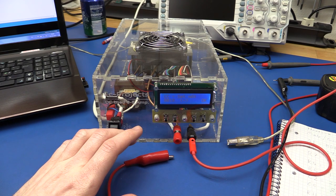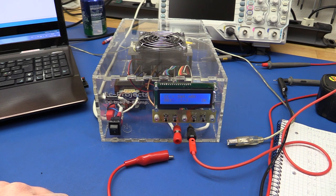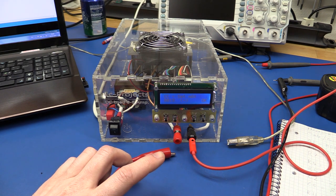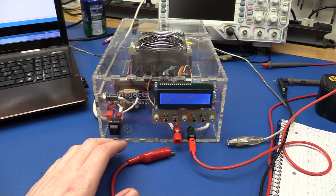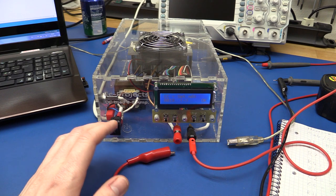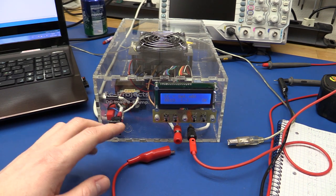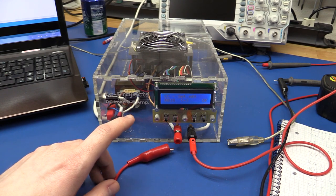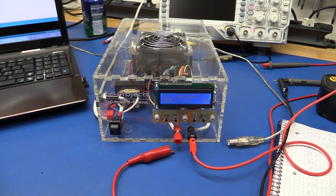I can get it to be spot on between say 3 amps and 7 amps, but then it will be a fair amount off down in the few milliamps. So I tweaked it to where it's acceptable, but I will have to make some changes in the software. It could also be that I could optimize the ADC a little bit. There are some parameters you can set in the registers that will change how it behaves near ground and near the top rail. I use the ground in the whole system as the negative reference for the ADC, and they do mention in the datasheet that that could lead to some problems. And they also tell what you can do to improve it a little bit, but I haven't looked into that.